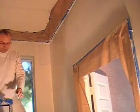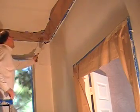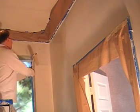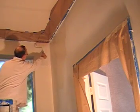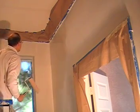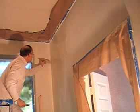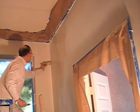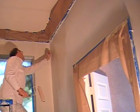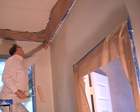And then you also have yourself a dry roller that you use as a tool. We're going to roll it. You don't want to hit the other wall. If this end of the roller hits the wall, at that point, it'll tear right into it. So what we're going to do is we're going to tap without going through the paper. There we go, nice. Get a nice light finish in the corner.